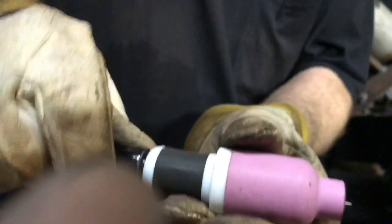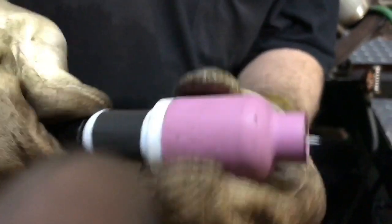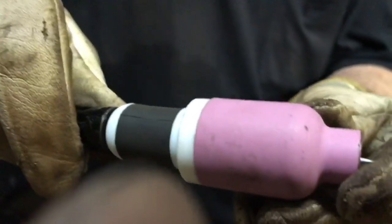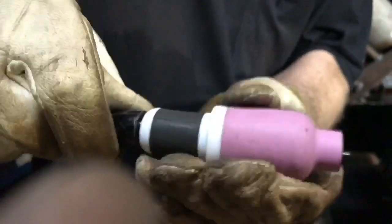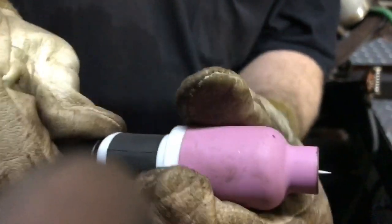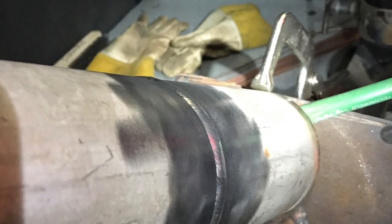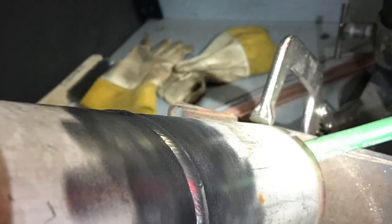And then on the cap, they want tight weaves — he wants it Charlie Moore style. Basically push that tungsten way into the cup like this, at about a 50 degree angle. You don't want the tungsten angle laid way back when you sharpen it. Grind it at about a 45 to 50 degree angle; it'll help you on these tight weaves. You're going to have to get that arm going fast back and forth.